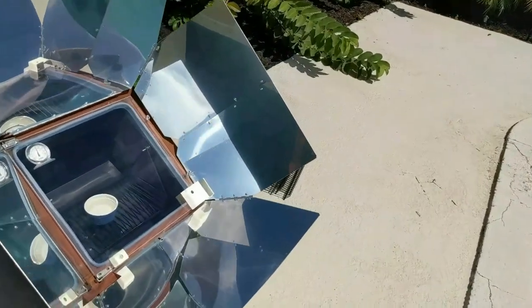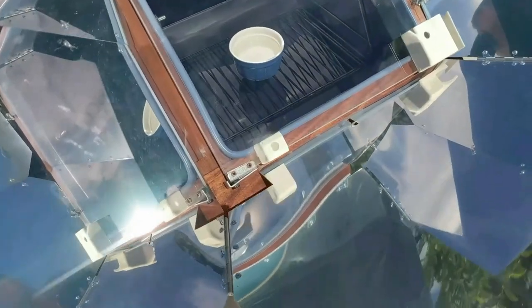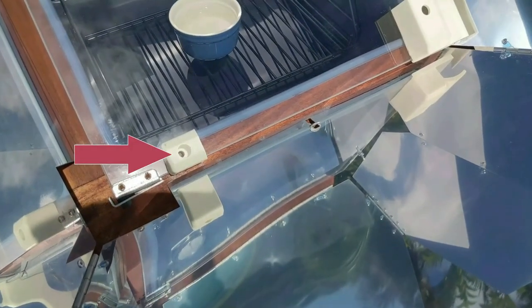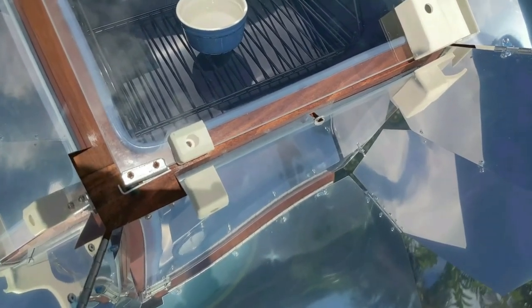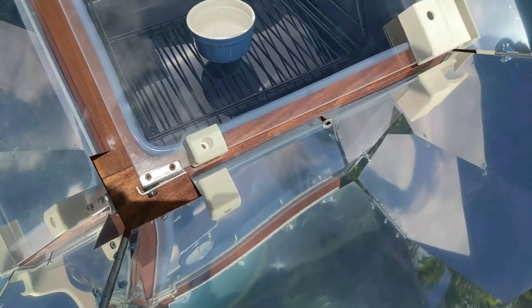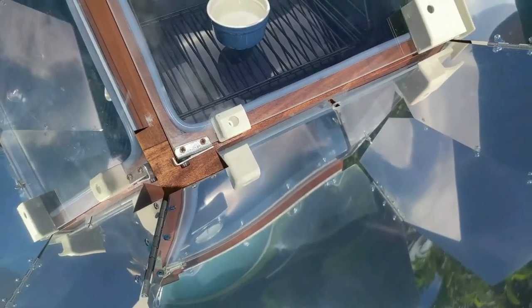I've come out, I've set it up and I've aligned it. Hopefully you can see. Yeah, there it is. You can see the light hole — it allows the light to pass through and it lines up with the little circle. So that means I'm aimed correctly at the sun. It lines up the elevation, which is the up and down tilt, and the azimuth, which is the left and right. It's aligned properly. We're getting maximum exposure.